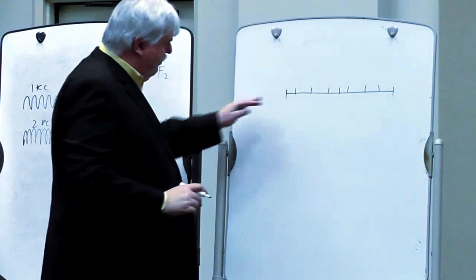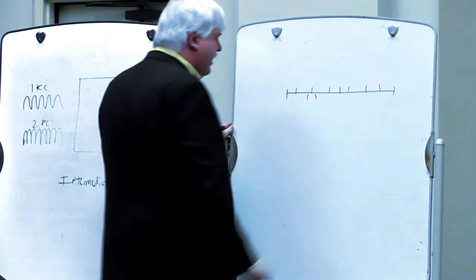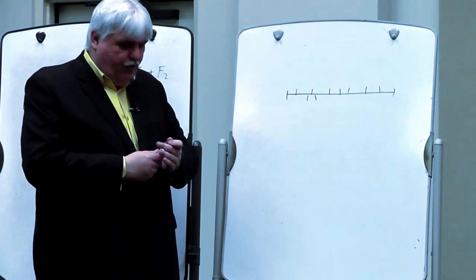But then when I take my oscillator and I vary its frequency, that means after heterodyning subtraction, it's only going to look at that area there, because when the oscillator is heterodyned with that radio station, then it produces something that is the intermediate frequency. That's a very important method for radio reception. It's the standard we use today.